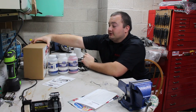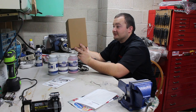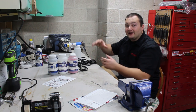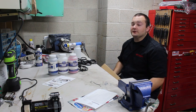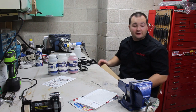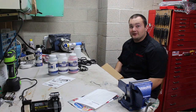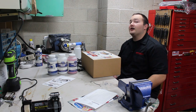Another benefit I found out after reading the box: you can't overcoat. It is literally impossible to apply too much. It only needs one CFM at five to ten PSI, so you can use a little pancake air compressor — it even says you can use just an air tank, you don't even need a big compressor. I have a 10 or 15 gallon air compressor and a 15 gallon air tank, so I can powder coat almost anywhere as long as I have an oven. You could probably buy a little $50 Harbor Freight pancake compressor and use this — you cannot do that with a spray gun.